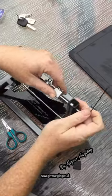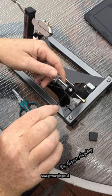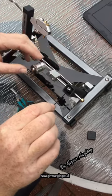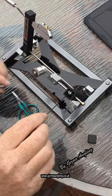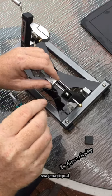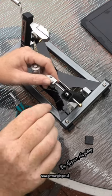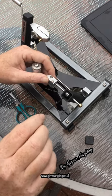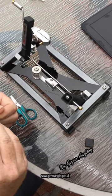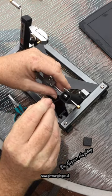We've changed this to one grub screw with two holes. The reason being it just makes it easier not having to undo two. That second hole is there so that if for some reason in the future someone over-tightens it and cross-threads it or strips the thread, we've got another hole they can use. These pulleys are actually used for quadcopters at 28,000 RPM and they use one grub screw, so I don't think anybody will be tying a hook that fast.